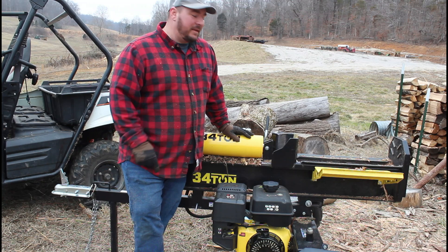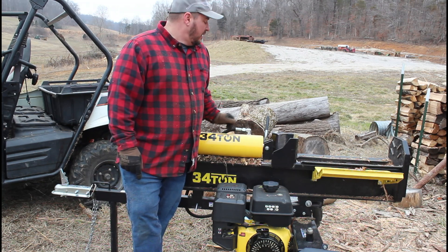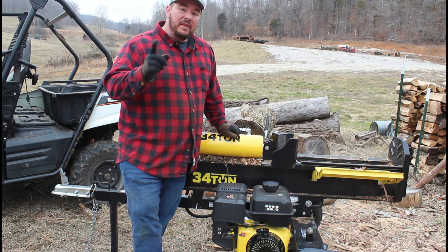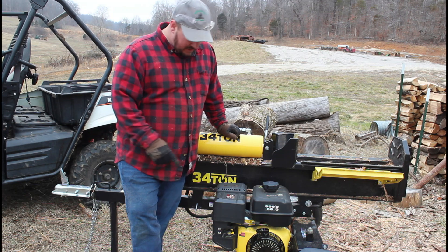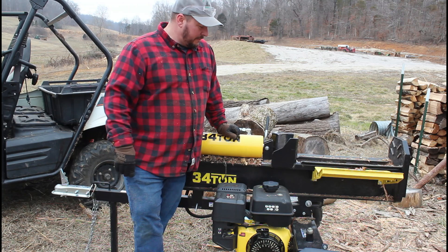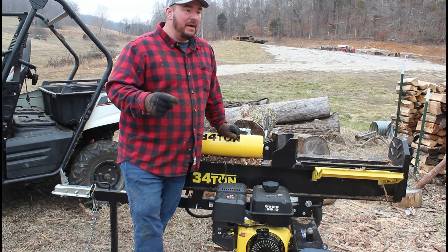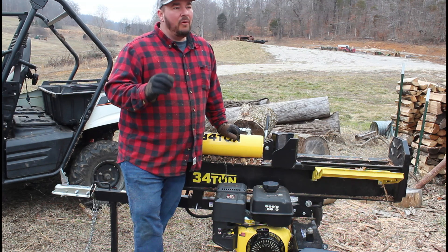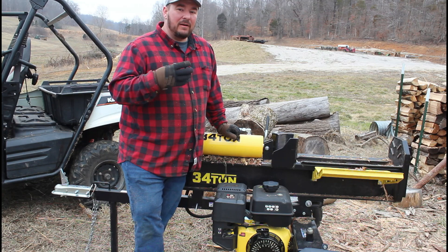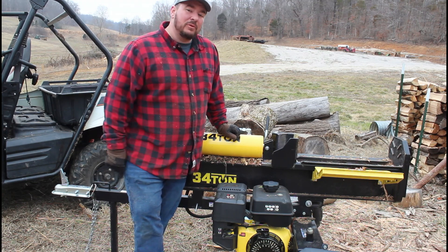Here's your Hawkman Outdoors Pro tip of the day: when you're getting ready to split some wood, let your splitter warm up a little bit — cycle it a few times and let that hydraulic fluid warm up, it's gonna go a lot smoother. Then when you're getting ready to call it a day, go ahead and cut your gas off and let all that gas burn up through there. It'll make starting your splitter a little easier next time, and if it gets really cold and you've got a little water in your gas, it's not gonna freeze in your carburetor and potentially cause damage. That's your Hawkman Outdoors Pro tip of the day.